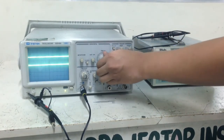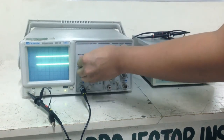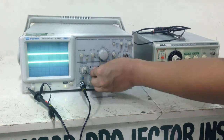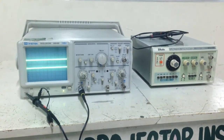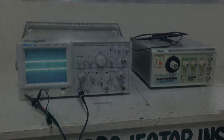You can also use the position knob to further locate your waveform. If your waveform is still unstable, try rotating the trigger position knob. Make sure the trigger isn't higher than the tallest peak of your waveform. Try fiddling with those knobs enough to display a single period of your waveform on screen, or try zooming way out on the time scale to show dozens of squares.